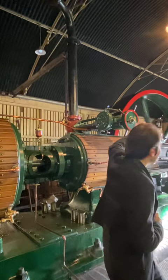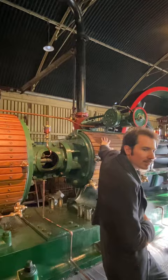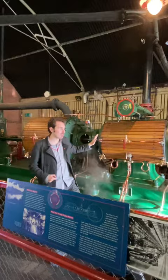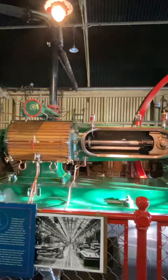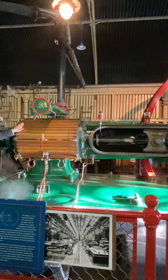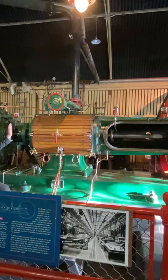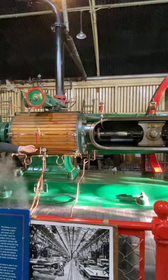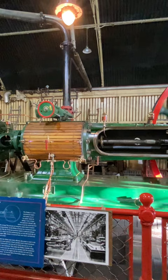The first thing we have on the engine is this device — the regulator, or main valve. This controls how much steam comes into the engine and how fast it will go. From here the steam enters this round section, the high pressure cylinder. Inside is the piston rod coming in one end and a large disc — the piston — travelling back and forth. On either side we have an inlet valve and an outlet valve. Depending on the position of the piston, the valves open and close — when the piston is at this end, the inlet valve opens, high pressure steam pushes the piston to the other end, then the opposite inlet valve opens and the exhaust valve opens, switching the pressure difference and forcing the piston back. It's an automatic process pushing the piston back and forth.